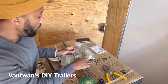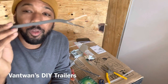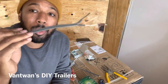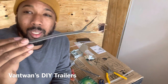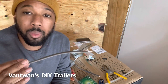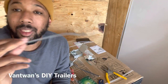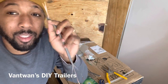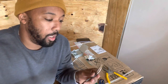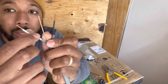And the wiring, you're gonna need plenty of this. So if you go to Lowe's, get 150, 250, however much footage you can, but get the max footage if you can. Maybe 250 feet should be plenty, but you can't have too much wiring, especially if you're going to be doing a lot of outlets or a lot of lights, depending on what you're doing. And it's a 14-2. It's a great wire. Again, this is the power wire, ground wire, and a neutral wire.